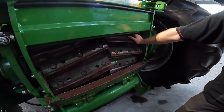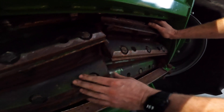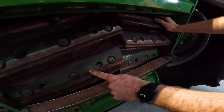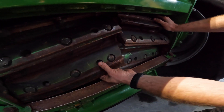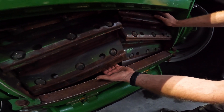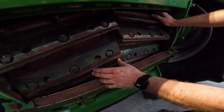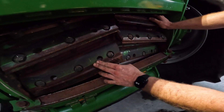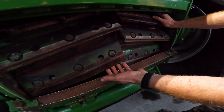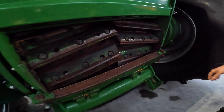Another thing about the drum before we close it up with the feed rollers — you can see here we have our knives. That's our full knife in and that's our dummy knife in, and that is for a grass setup so we can have a wider range of chop. But you can also see this drum is a bit different: the knife hangers are above the knife. That does a couple of things — it means there's more room behind the knife. Because normally the hanger would be underneath it and that would take up all the room. It also makes securing the knife stronger, so that if you do meet an object, you're not relying on the bolt to hold it in place — you're relying on this big hanger as such. Hopefully you don't meet a foreign object, but when you do, the knife should splinter off. Most of the damage from a rock doesn't come from the rock itself — it comes from what it breaks in the drum, and then that goes up into the blower.